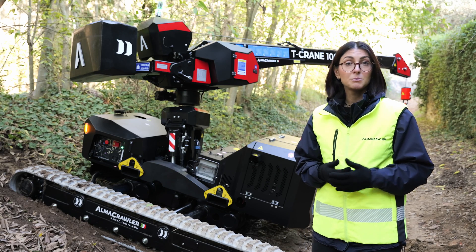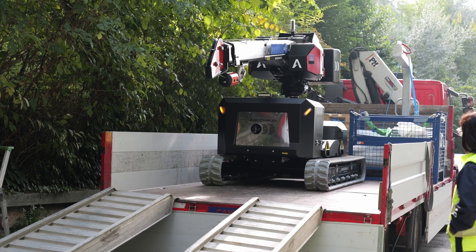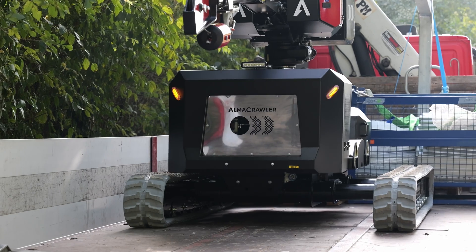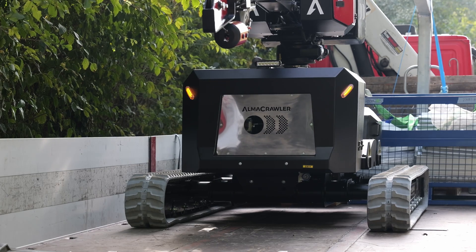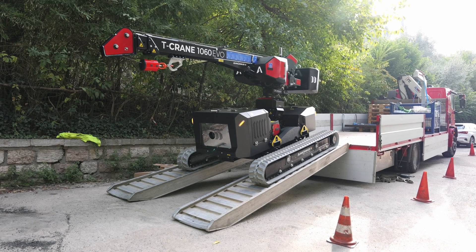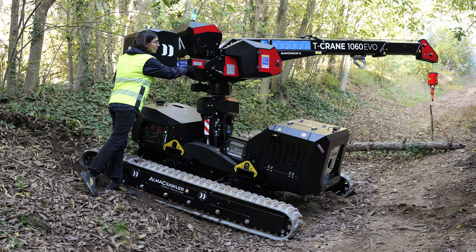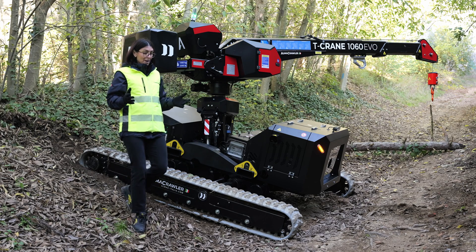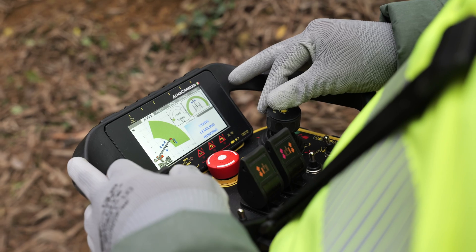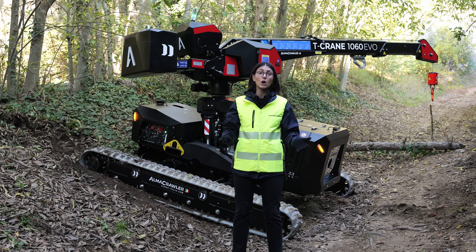This machine is very compact. When fully closed, it stands at just a little over 4 meters 20. It's also very lightweight — the Yanmar diesel engine version you can see right here is only 3.85 tons. Its unique feature is that the counterweight is completely removable, with quick releases allowing full removal. By removing the counterweight, the total weight goes down to 2.85 tons, making it transportable by trailer and usable in situations with overall weight limitations.